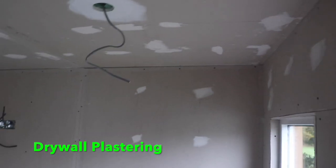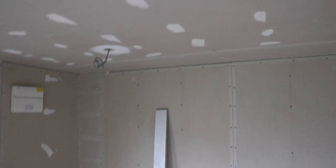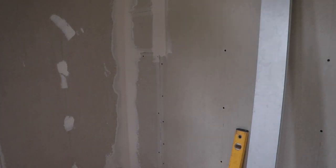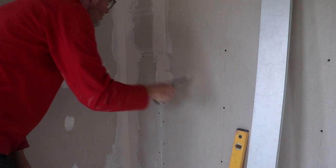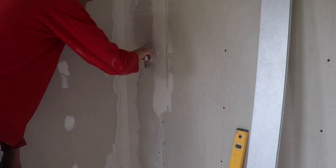I've just spent a bit of the morning putting some scrim tape on all the joints. The next job is to get some easy fill and start going over the joints in the plasterboard. So the plasterboard is all in. I made a mix of easy fill 60-minute setting drywall plaster from Gyprock — it's a nice consistency for filling in the joints and making sure I cover the scrim tape.